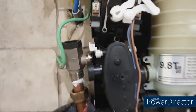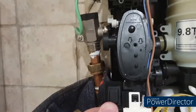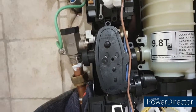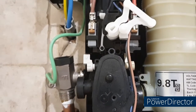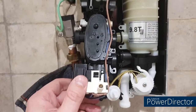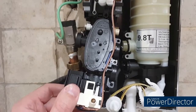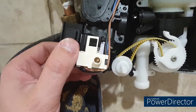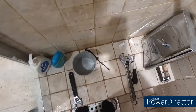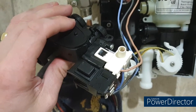In addition to those Torx screws, I removed the one holding this whole assembly on this sprocket, because I couldn't remove the belt over the top of it. Drop it down and you can wiggle this entire assembly free — remove it from the two fittings onto the tank by wiggling it to the left. The two actuating arms at the top will drop down. Bear in mind the hot water tank is full of water, as is the valve itself, so when you move it out you will flood the place — make sure you've got something there.